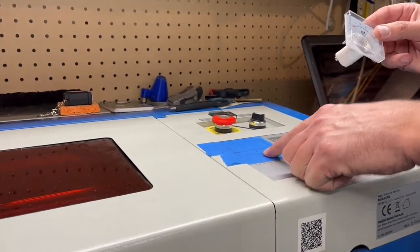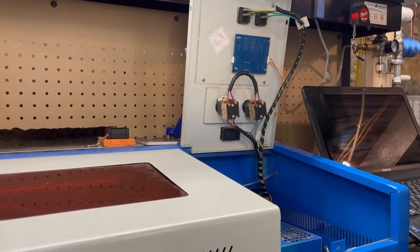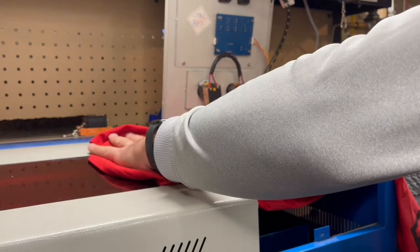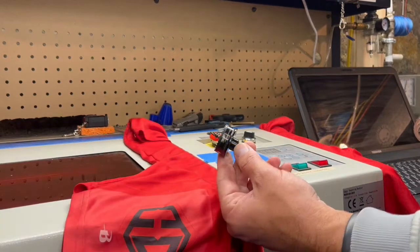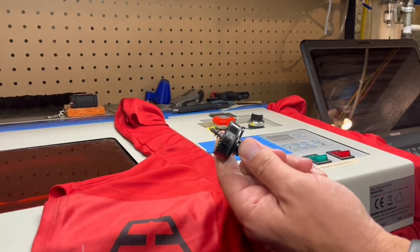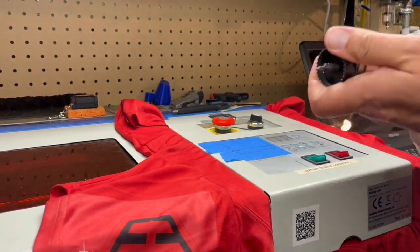I've marked off an area and we're gonna mount this right next to the percentage meter for the laser. Underneath here we don't have anything, so what I'm gonna do is lay a shirt down to cover what we have inside there so the power supply doesn't get any shavings in there. Then we'll go ahead and make our hole. I'll be drilling with one of these Milwaukee Shockwave knockout drills, usually used for electrical boxes — this is a one-and-three-quarter inch. I'm still gonna have to file a little bit on the edges for those oval parts of the amp meter.